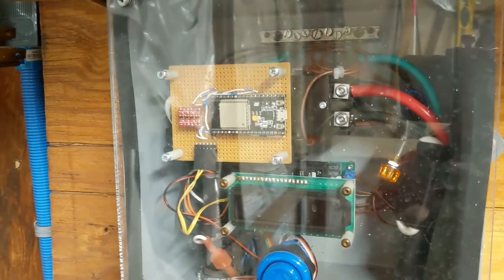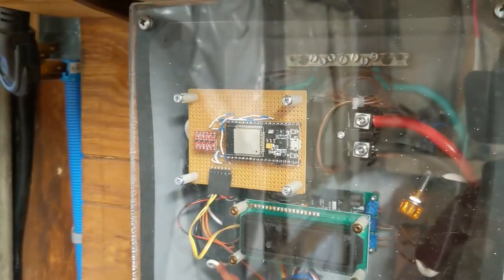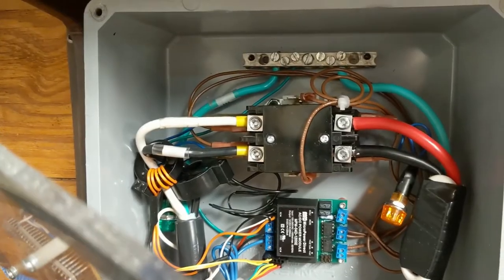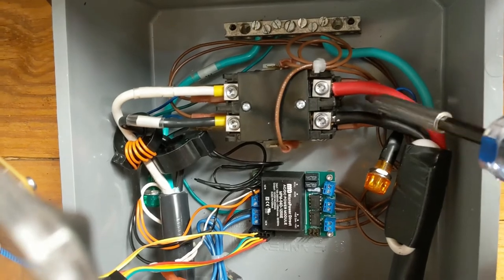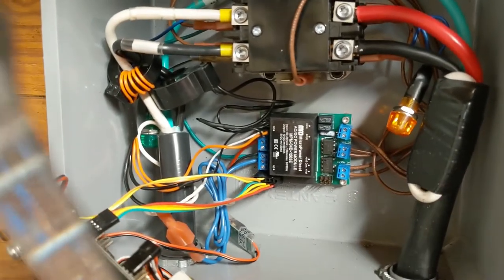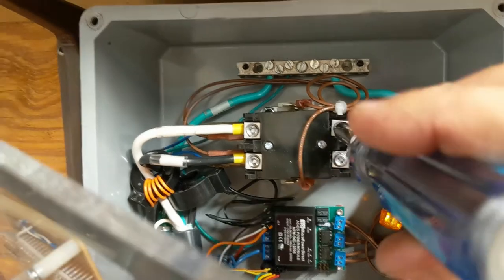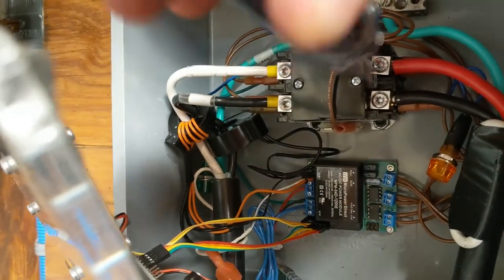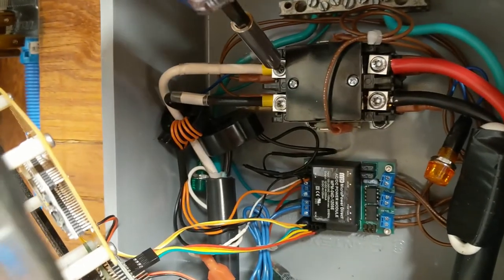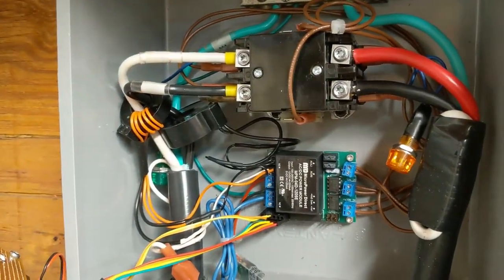Here's a homebrew rig — it's powered down — and you can see it's got a plexiglass face. There's the contactor in there. I'm going to give that a try and see how it's holding up. This is the one I use every day, so it has a lot more thermal cycling and is more likely to become loose. This is the set of wires coming in and this is going out to the plug. There's a little controller down there — it's an open EVSE — and this does everything the Blink unit does and more. Let's check it — nice and tight on the output side too.